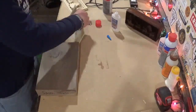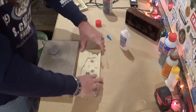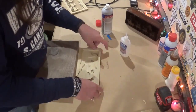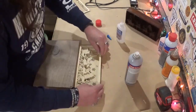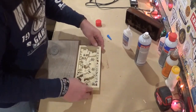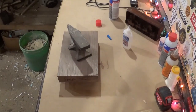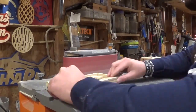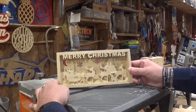Then it was time for assembly. I'm using medium grade CA glue and activator for the glue-up, and I'm using a two inch thick chunk of walnut to help keep everything flush and lined up during the assembly process. You can go about the assembly in any way you like — this is just how I felt I could keep everything lined up. After everything was glued up I added weight to the piece, let it dry and cure for around five minutes, then went over to the belt sander and flush sanded all four sides.